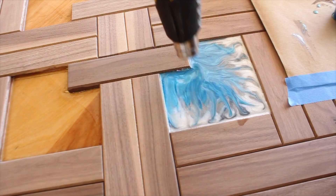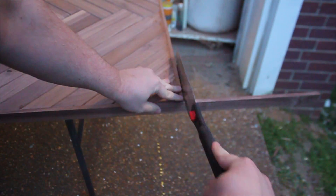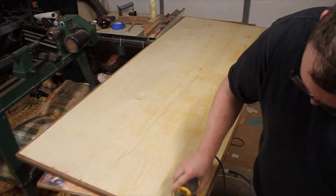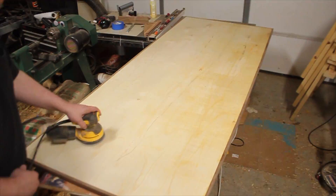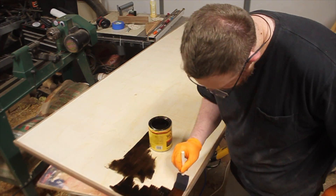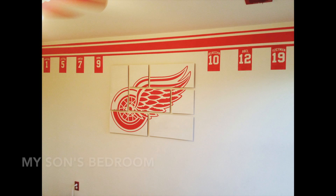Here's a sneak peek showing the cured resin. You'll want to add a border along the side of your door — just glue and pin nail it, then trim it flush. I simply sanded and stained the plywood substrate since no one's going to see the back side of my door. Well, unless I'm trapping you in my laundry room for speaking ill of my Red Wings. Go Wings.